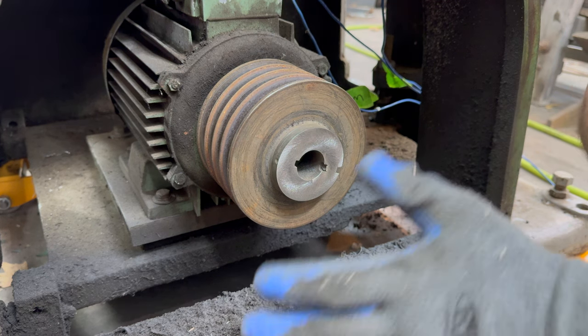The quick change gearbox is held on with four bolts, two accessible from the front and two from behind. To get the two from behind, a ratcheting wrench is definitely the tool of choice. I'm also very happy that I took off the change gearbox. There was a lot of stuff to get clean behind it, and it made everything so much more accessible when it comes to painting later. And perhaps it should be no surprise that this change gearbox was full of gunk and metal shavings and all sorts of nastiness.